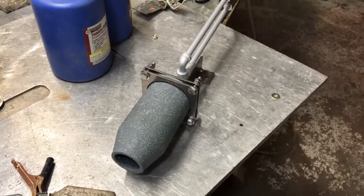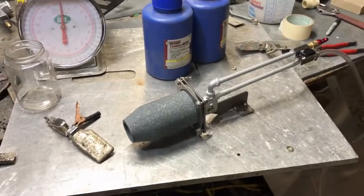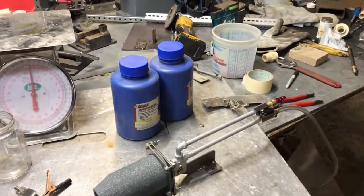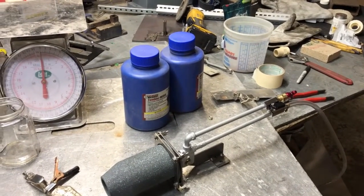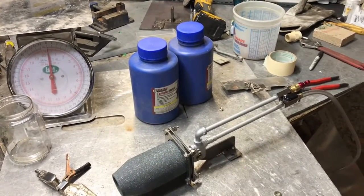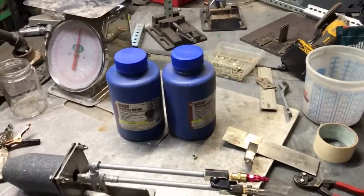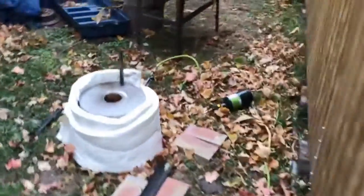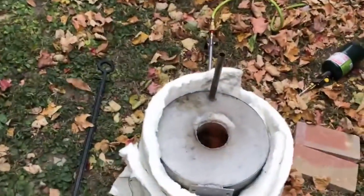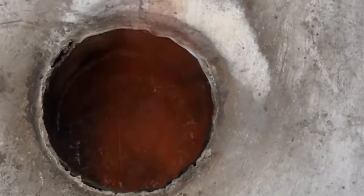That's going to be the main feature of the video, but in the meantime we're going to gather some data for a client. As I said, I won't be talking too much about what I'm doing to this stuff, but I'm going to be doing some testing with treatment to avoid losing so much in the furnace. Dry air is essential if you're going to achieve max temp, so we've got a significant air drying system in place. We're going to start this thing off slow so we don't destroy the crucible or boil the flux out too fast.